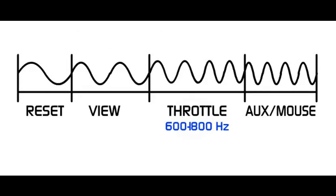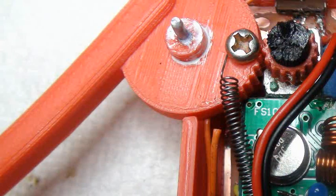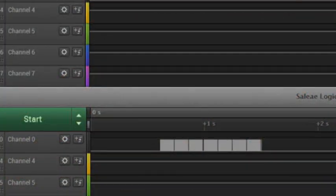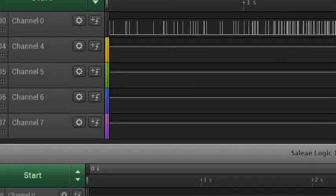For example, the throttle uses 600 to 1800 hertz while the change view button uses 300 hertz, the reset button uses 100 hertz, and the auxiliary button — which is presently set to bring the mouse up briefly to look at the wing and then back down — uses 2000 hertz. This was achieved by simply switching in extra capacitors or resistors but only works when the throttle is out fully. It's a compromise, but I'm willing to live with it. There had to be some timeouts and noise catchers in the software because when there's no transmitter on, the cheap receiver sends out random data once its AGC comes up. This is really annoying, but some clever timing resolved it.